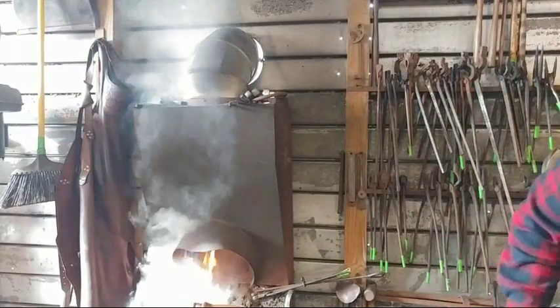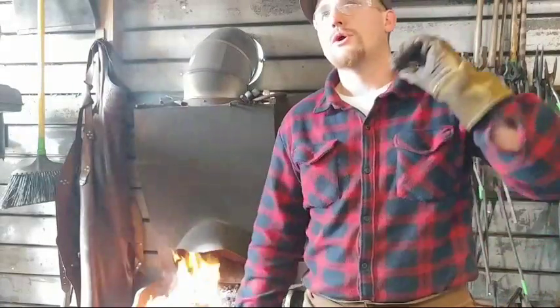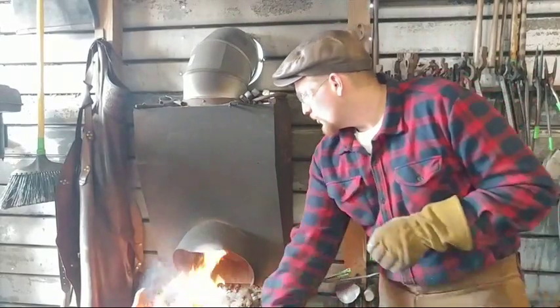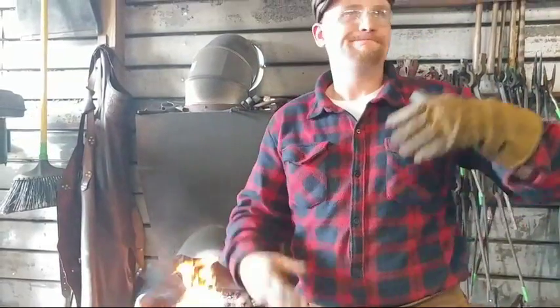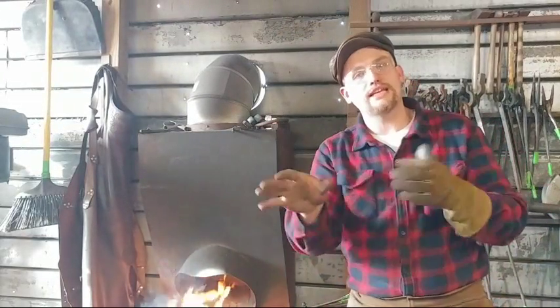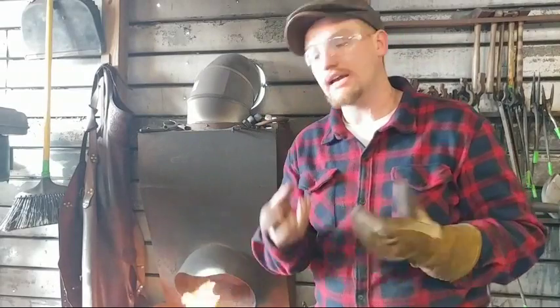Thomas Erso asks: for a newbie, what is chasing? Chasing metalwork — there's repoussé and chasing work, where you've made a depression and then refine the lines of that depression. But the form of chasing I'm doing is essentially moving metal to where you need it — that's what Tom Latane taught me. In a thick material, I'm moving the surface material to where it needs to be to form a design or pattern.